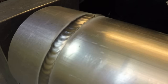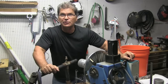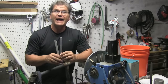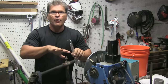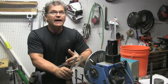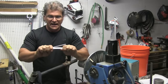Isn't it something to make a decent-looking weld and then have it machined off completely? Well, that's what happened on this part. A good example of what happens when you weld aluminum can be shown using a small strip of aluminum. I've got a couple of strips of 3003 aluminum. This is very common — what you would see on a truck box. Diamond plate is typically 3003 H14. The H14 designates that it's been work hardened and then partially annealed so it can still be stamped, formed, bent, and rolled without cracking to a great extent. Also very weldable, though not heat treatable — you can't make it stronger by heat treating it.